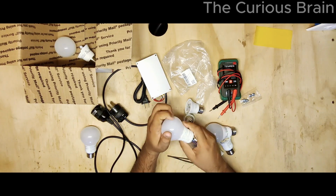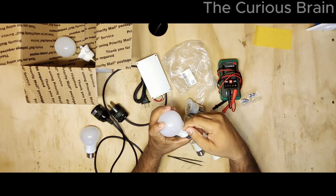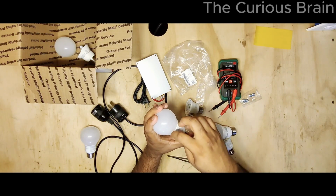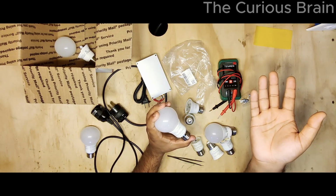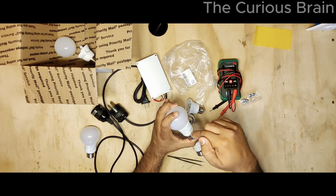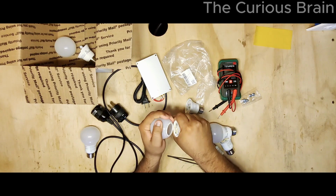So the very first thing is you have to hold the bulb tightly and try to bend it. If it doesn't open, you can use a credit card or something. Don't use a heavy screwdriver, because that can really bend the plastic or maybe crack it. So try to be gentle. I normally use a plastic credit card, any bad credit card that you don't use, or maybe it was canceled or replaced. Or I use guitar picks, something plastic and not too hard. So you put it in there, twist a little bit to break the seal, and finally you just bend it and it comes out.